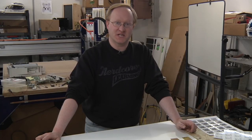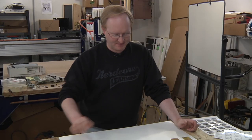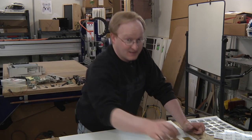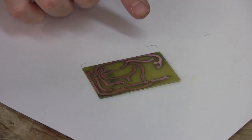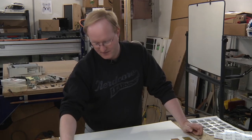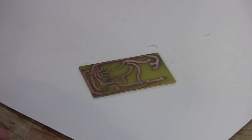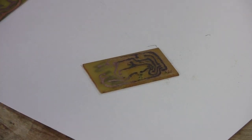We've made PCBs using several methods and now we're going to look at the results and see what worked best. The first thing we tried was drawing the traces using a black magic marker felt-tip pen. It definitely works, of course, but it's limited to your artistic skill. This is a timer circuit that was drawn up and it should work — we got pretty solid traces out of it, but it doesn't look super pretty. This other one had traces that weren't solid enough and the etchant ate into the copper in a few places.